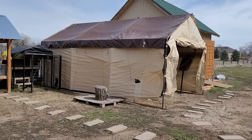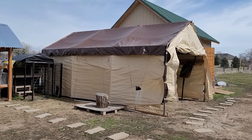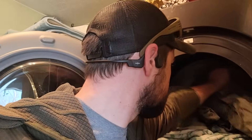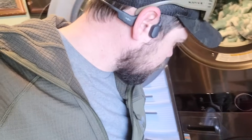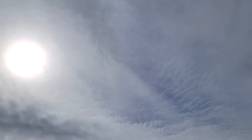It's a really windy, cold day. My side-by-side carport is getting pushed around quite a bit by the wind. For at least a short while, I got 5,200 watts of solar input. Unbeknownst to me, someone had run a load of laundry in the electric dryer, which uses about 5,500 watts while running. I'm both slightly worried as well as quite impressed that it ran a heavy load of blankets on electric heat without overloading the inverter of the Delta Pro Ultra — and that's all while still running the rest of the house.